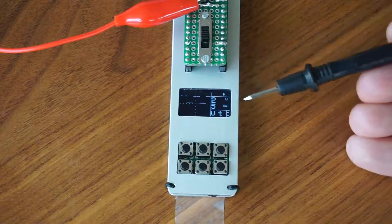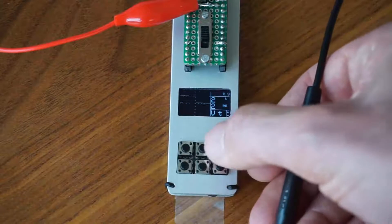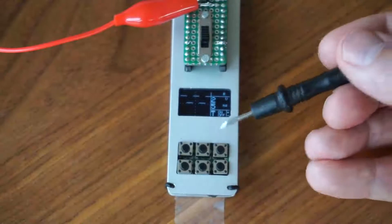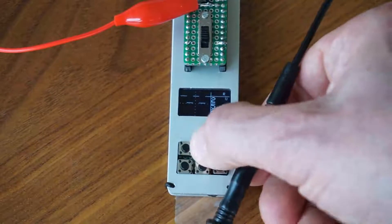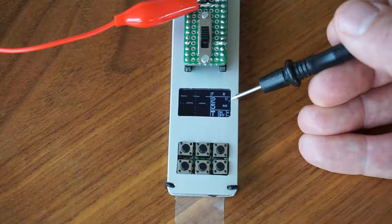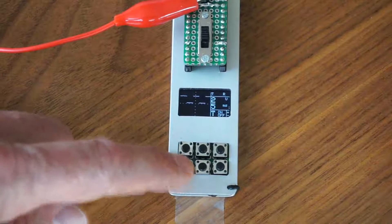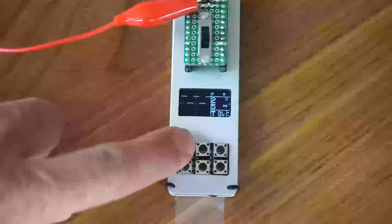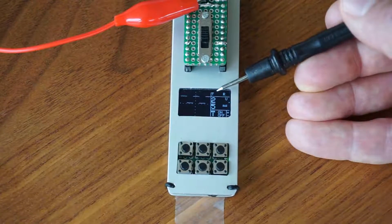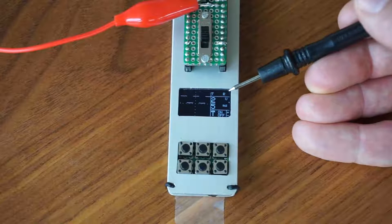This is a better view — currently not triggered, but in the next menu you can switch the trigger on. Here you can see a very small arrow which indicates the trigger level; you can lower it or raise it, so now it should work. Note there is an indicator line which shows T for triggering and R for reference signal on.